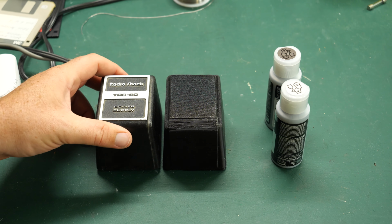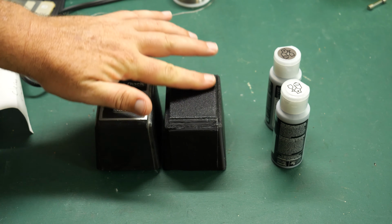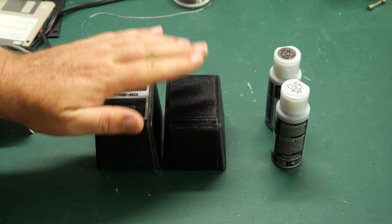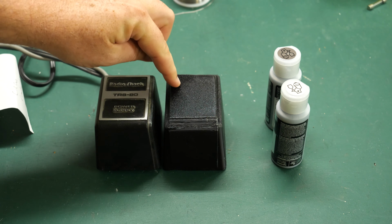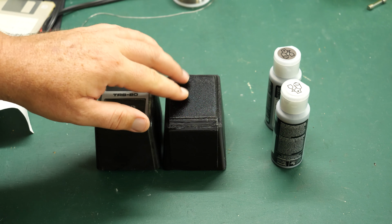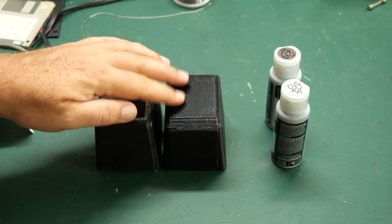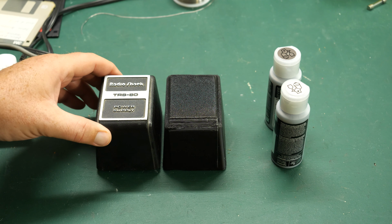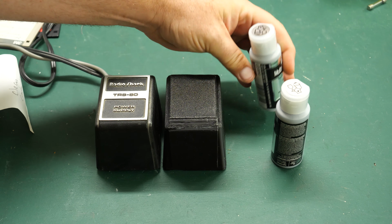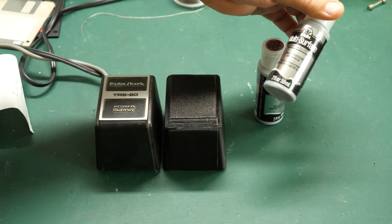Okay, there's one other technique I want to try, and that is to go ahead and paint the top surface before I laser etch it. Paint the whole thing, let the paint cure, and then go ahead and laser etch the pattern out, cutting out the painted layer along with the plastic layer underneath as it goes. So I thought I would try that, and I've got two paints here. I didn't know exactly what they would look like, so I just ordered the closest things I could find.